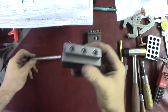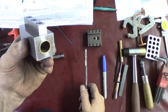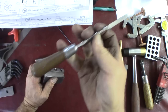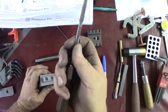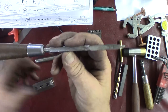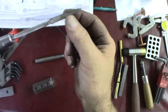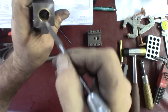In one of the other videos, I think on the rotary broach, somebody asked me how I got the burrs off on the inside of a bore. I tell you, a triangle scraper is one of the simplest, easiest tools. Just make it from a triangle file. They're already hardened, so grind and sharpen, and put a handle on. I've had this one my whole life. I got it from my father, and my grandfather actually made this one. And you can see the file serrations, so that's kind of nice for cleaning up your fingernails right there. Anyway, this thing is just wonderful for reaching in and working like a little bearing scraper, and you can just scrape those burrs right on off.